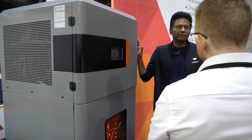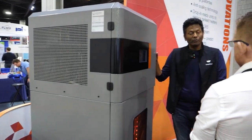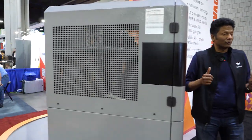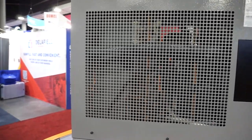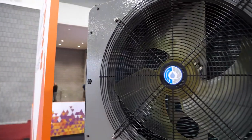This unit is a perfect fit for commercial restaurants. If you have a McDonald's, you would want to put two of these — you would take out two gas-fired units and slide this one in. It will start absorbing all the waste heat that is there in restaurants and convert it into useful hot water. With that 90,000 BTUs, this unit will provide about 10 to 12 gallons per minute on demand.